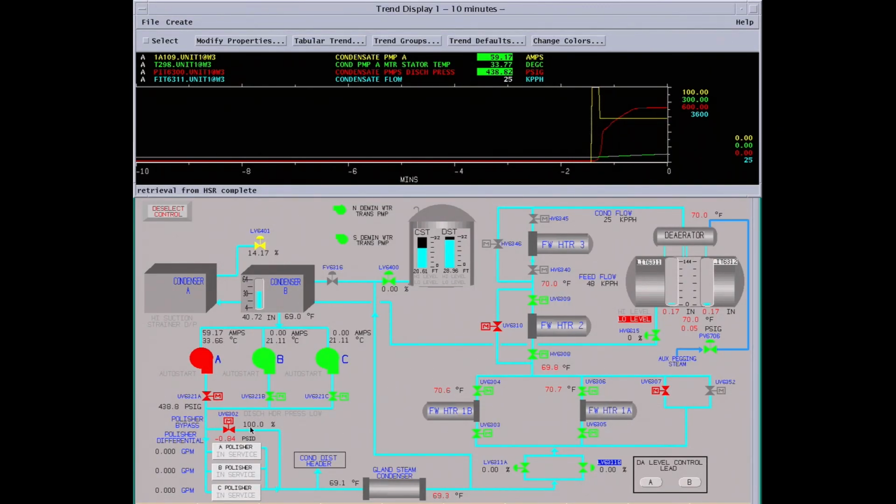They're bypassed right now because we have in our water treatment chemical. We've used hydrazine. It's been added as an oxygen scavenger to prevent corrosion. All our feed water heaters are bypassed. They have copper tubes in them, and we don't want to hit them with the water treatment chemical, and also don't want to water hammer them during startup.